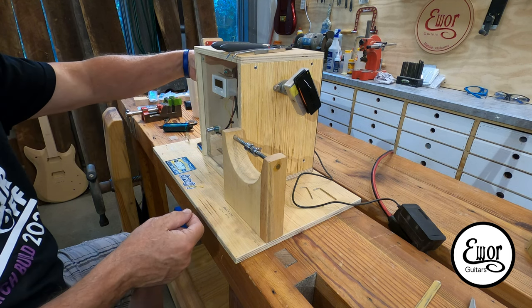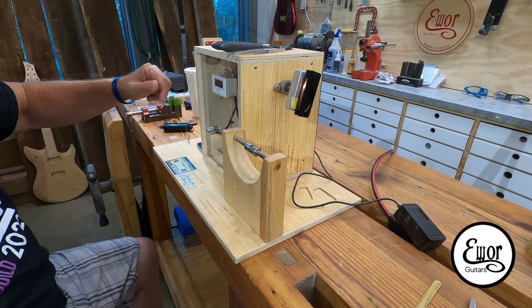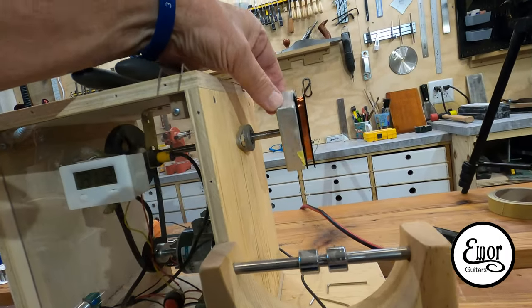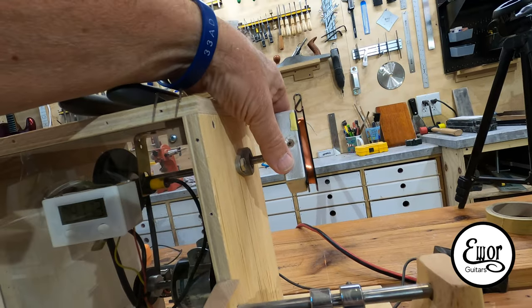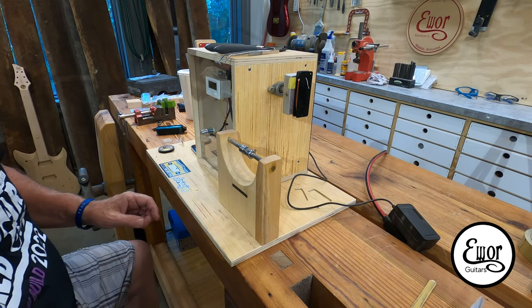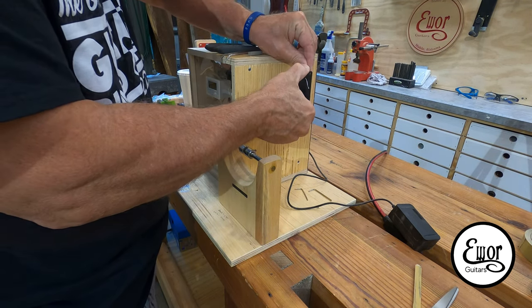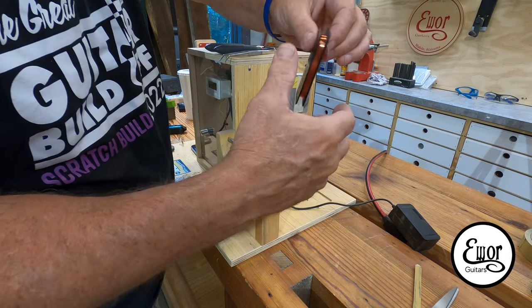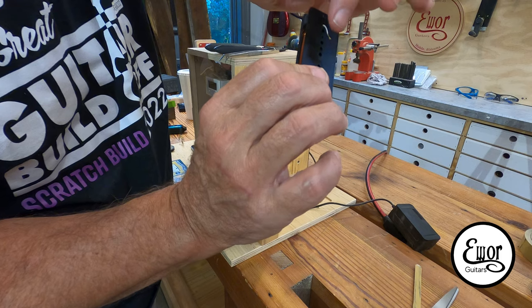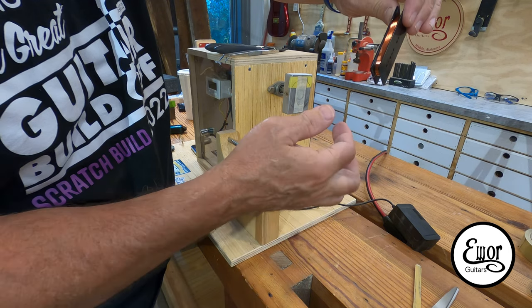9,100 turns — 9,100 and 12. I am quite pleased, that looks really nice. It's filling the whole thing nicely and laying in there tight. I'm very happy with that. I'm going to go ahead and cut this here and simply pull it off of my winder. There it is — I think it looks good. The white wire coming out of the middle is the start, and the other end is going to be my finish. Now I've got to go solder the lead wire onto the finish right here.